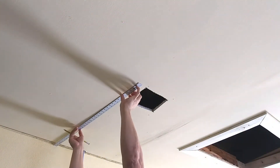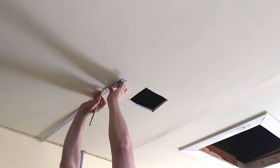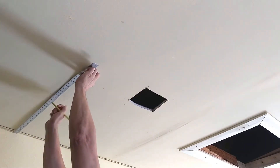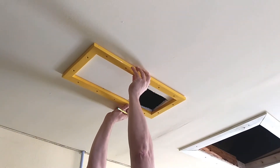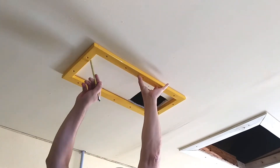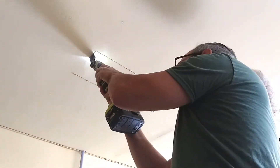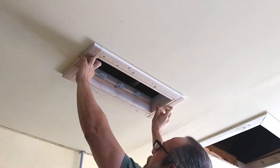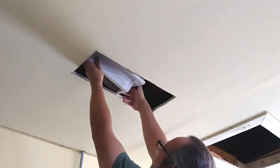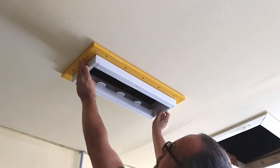After making sure all the pieces were dry, the next thing was a dry fit. But before that, I needed to open the hole in the ceiling — right now it's about 8x8 and I need to make it big enough to hold this fan shroud. To make the opening, I measured from the wall, tried to get the hole as square as possible, and used my multi-tool to open it up. After being satisfied with the fit, I dropped it into place and tested the outer ring, which will serve as the clamping mechanism to hold the structure in place.